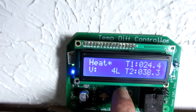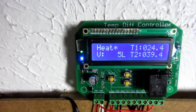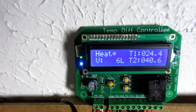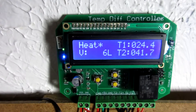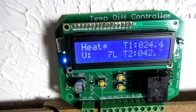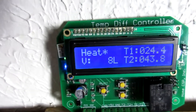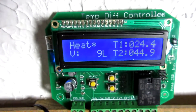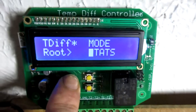And we go up top here — there we've got four liters, five liters, six liters. It's a little tiny pump. So now, based on this temperature differential, there's a certain amount of calories required to heat up the amount of water that's flowing through here, theoretically, at this temperature difference and this flow rate. We can keep track of that, and we convert that to kilowatt hours.